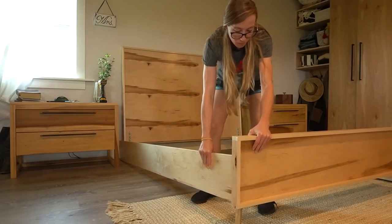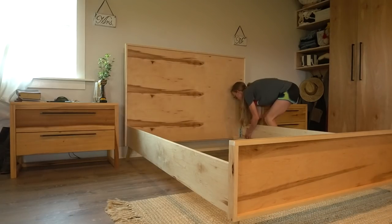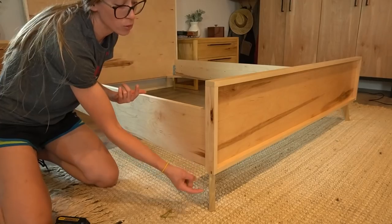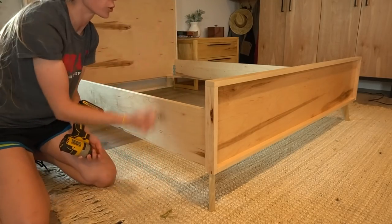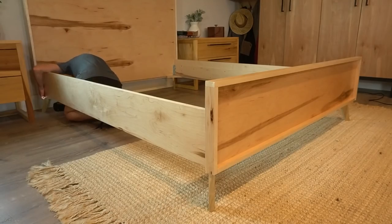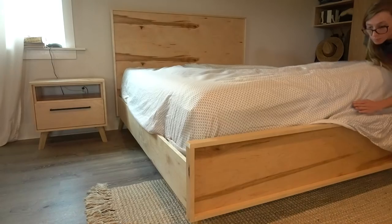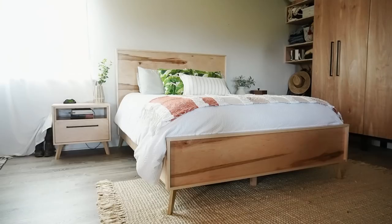I gave these pieces a few coats of clear poly and then brought it inside to assemble. Once the bed was together, the triangle leg pieces weren't secured to the side panels — only to the footboard and headboard — so for extra security I shot a screw up in every corner to attach those triangle pieces to the side rails as well. After securing the feet to the side rails, I evenly spaced out the slats and screwed them in place, then threw on the mattress, sheets, comforter, pillows, blankets, and took a break to recover from this build.